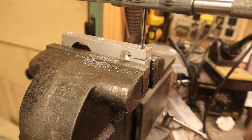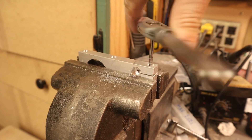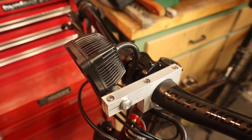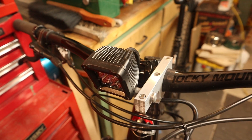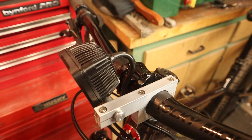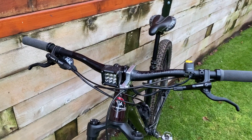The bracket is almost done. I went ahead and drilled the holes, countersunk them a bit, put a groove in, and now I'm tapping it so I can pinch the rod for nice adjustment. The initial test fit is very adjustable — I can mount it on top or flip it and mount underneath the bar, which I might do. It's very rigid. I still need to round over all the edges so you don't smack your knee and wreck your night if you bail.